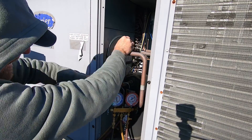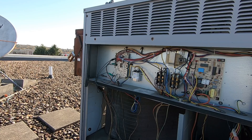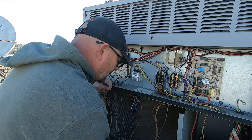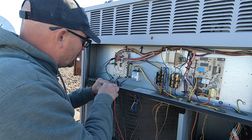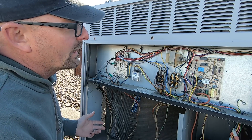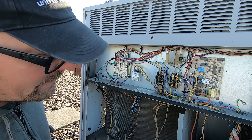Now we've got pressure. Alright everybody, I've got no voltage coming through our low pressure switch — I've got it pulled off the board and we've got no continuity through the low pressure switch. We've got continuity through our high pressure switch though. So as it appears right now, the low pressure switch is open. I'm going to give that low pressure switch a small tap and see if it closes.